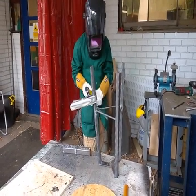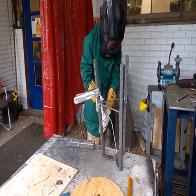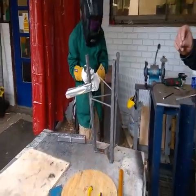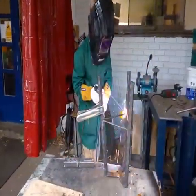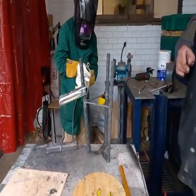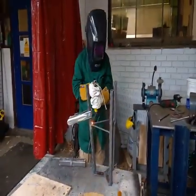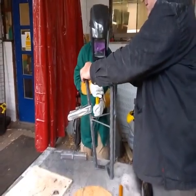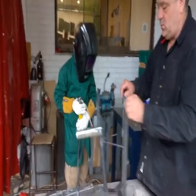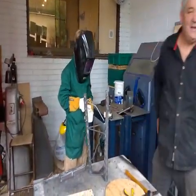It is more difficult, so do a little flap, but try to keep it in the middle, because remember we're going to want to clean that up with the grinder. That way you're just warming the tip of the rod up and making it easier to go, yeah? So that's nice. There, okay, enough. Get it right in the corner, yep, there. Be careful because you will have to weld in difficult positions, but if you can move the piece to suit you, then why not do it like that? So then do that again.